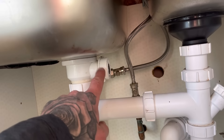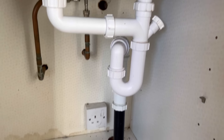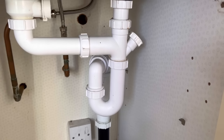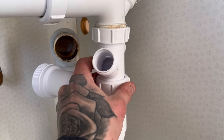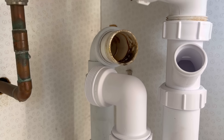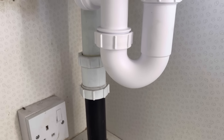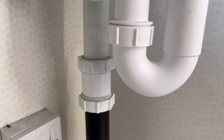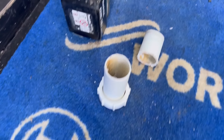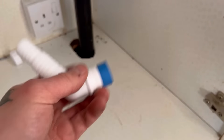So I'm back here again because I rang the landlord and said I've sorted out the leak issue, swapped the strainer waste. However, the tenant might find it difficult to connect a washing machine because they'd previously used the overflow part. He said, well what can we do about it? I said we just need to swap the trap for one with a washing machine adapter on. That's what I had in the van, that's what's getting used. Didn't really need to be adjustable but it'll work. So we're here to swap that back. Because this is an adjustable trap, if I undid that nut there you could slide it down — but I want it all the way up. As you can see it still needs a little bit cutting off because we've got this little extra piece in now — which is no problem. Just disconnect that 40mm McAlpine compression coupling and shorten that pipe, should go straight back into that old elbow.